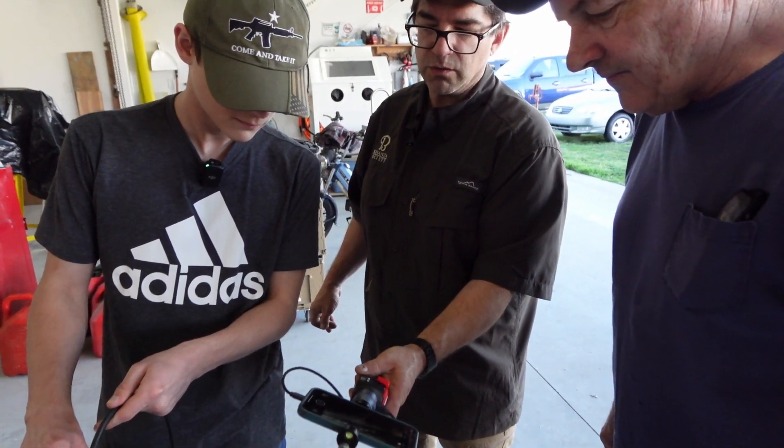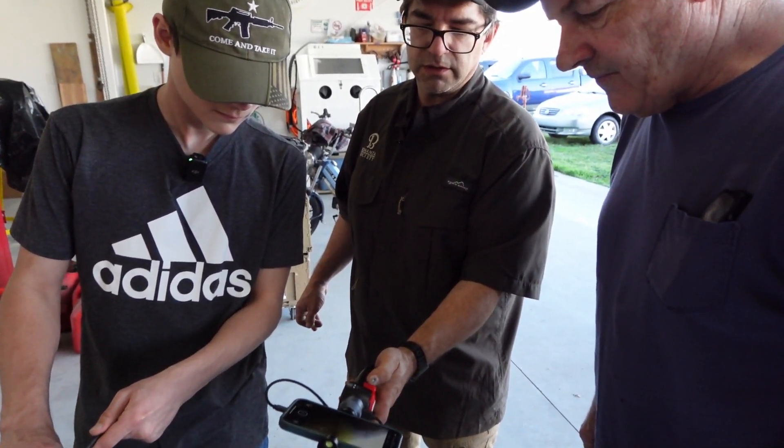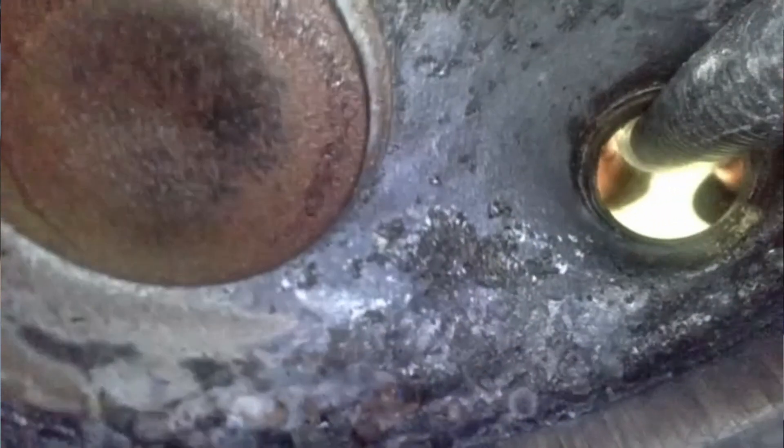There's a little bit of scoring right there, but it looks pretty good. Go all the way down into the cylinder and then I'm going to turn the head around. That's the exhaust valve right there — and that's good, it's a good burn pattern. See how it's concentric? It hasn't got a green place on one side where it's been burning.